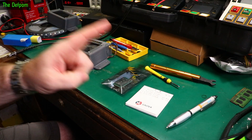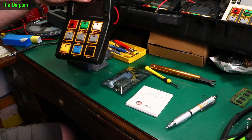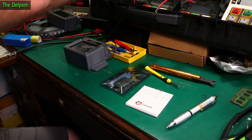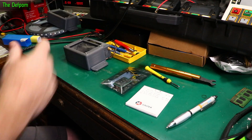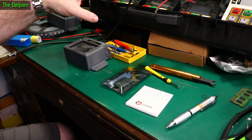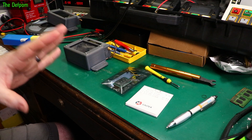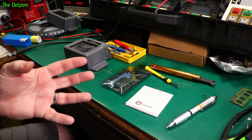I've been having problems with unit one, which is this unit here and the accompanying paired keyboard which goes with it because they're done as a pair. Both units have been playing up. I actually rebuilt unit one and that's working okay now, mostly - seems to be a lot better. I replaced the ESP32, replaced the LoRa module, and it's been behaving better. Previously it was behaving really badly.